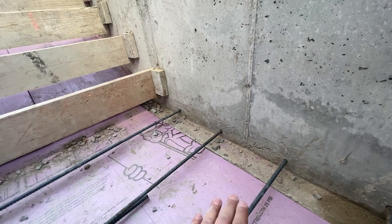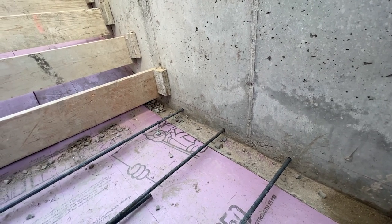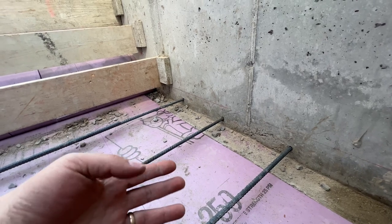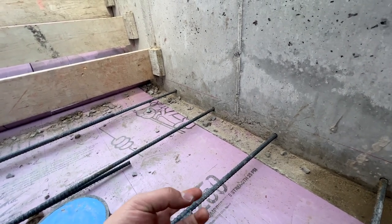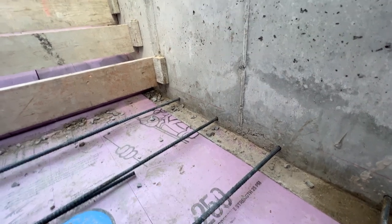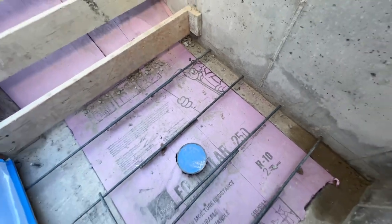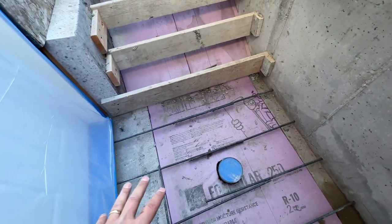So right now as it sits, these footings are only going to be four inches below grade, which is essentially just the thickness of the concrete. What can happen is the moisture underneath the footing in the soil can actually freeze and create a frost heave, where that water expands and lifts the footing up. So this insulation is an important part of the project — you have to install this so that the footing area is safe even though it's not 30 inches deep.